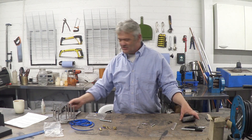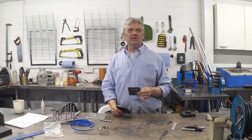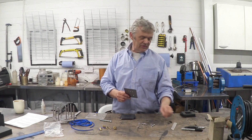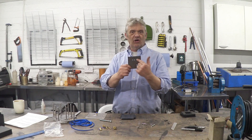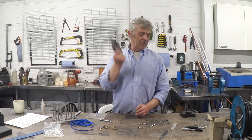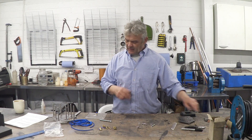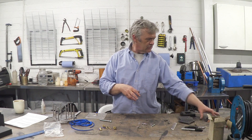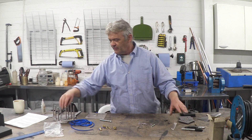So I prepared 10 neutral plates from graphite foil and they were a piece of cake — I cut those out with scissors, then used hole punches to punch the electrolyte hole and the gas holes. Made 10 of those in maybe 20 minutes. Then I made two end plates and buried a bit of copper into each end plate for a current collector, to do two cells in a dry cell configuration. I also made a midpoint plate.